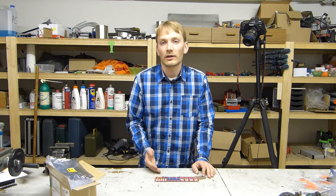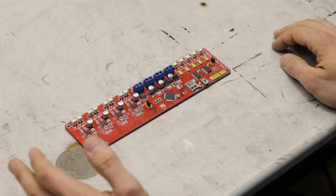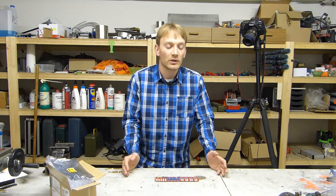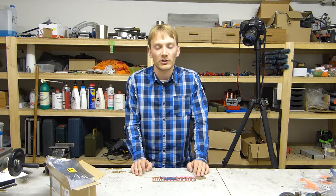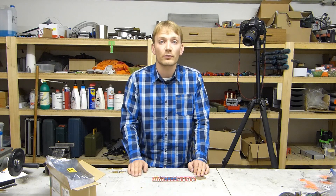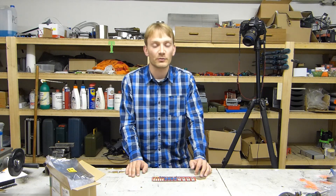So would I recommend this board to others? No. The wrong choice of thermistor pull-ups and the substandard MOSFETs ruin it for me. They make the board unusable for anyone who isn't an expert user, and the last thing we need is another brick in the road when it comes to building a 3D printer. Would I personally buy it again? Probably. Swapping in proper pull-ups is a quick job when you have the right tools, and even the MOSFETs aren't bothering me much. I'll be expanding the board for dual extruders and just use the onboard FETs for the hotends and power the bed through an external, beefier MOSFET. But then again, if you know what you're doing, you can fix about anything. G-Tech really could have done a better job with this board at minimum effort.